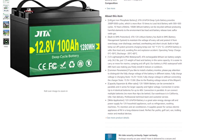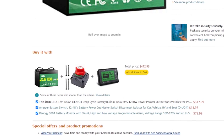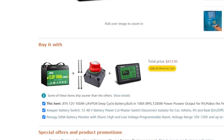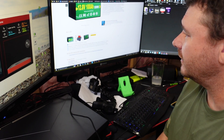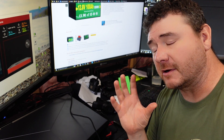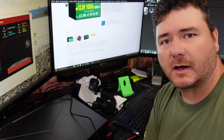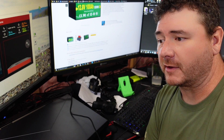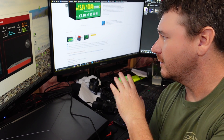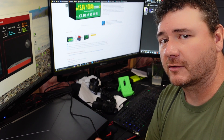As far as the description, nothing really stands out. I do not see low temperature charging protection. It says IP65 waterproof with ABS hard case. So if you're looking to buy this battery for a trolling motor, like maybe on your kayak, this combination probably isn't a bad deal. You can get your master switch and a shunt. A shunt more accurately reads your battery capacity, as opposed to using a voltmeter and trying to figure out where you're at from there. Using a battery monitor with shunt is going to be the most accurate way to gauge how much capacity is left in your battery.